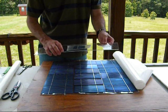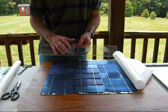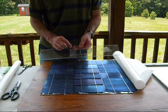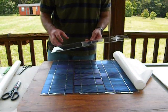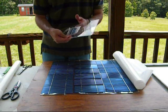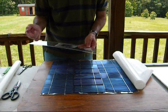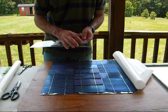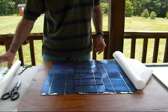I'm going to use this plexiglass here that I experimented with to make sure it wasn't going to melt. As long as I kept it on the lowest setting of the heat gun, which was 430 degrees Fahrenheit, I didn't have any problems with the plexiglass melting or deforming. But then I also tried the 570, which is the lowest high setting, and the plexiglass started to warp. So just stick with the lowest setting you have on your heat gun.